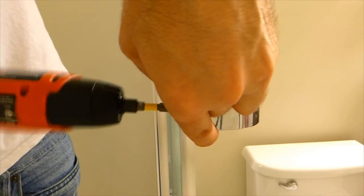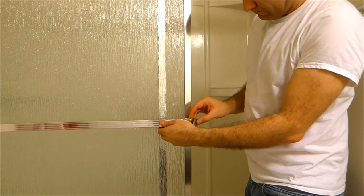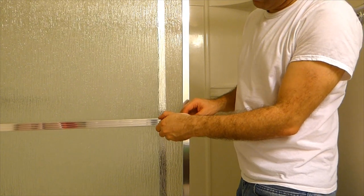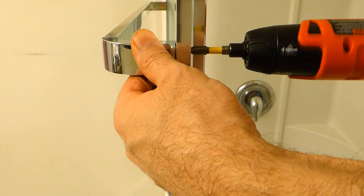For the towel bar installation, just insert the towel bar brackets into the outside panel and secure the towel bar with four flat head screws. As you can see, one side is perfectly perpendicular, but the shower side of the enclosure is not — it looks like the builders did a really bad job.